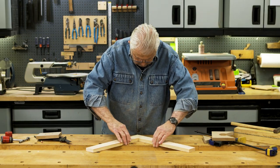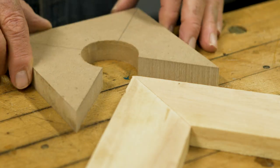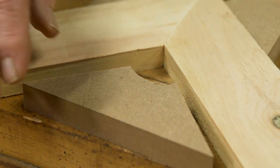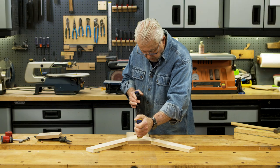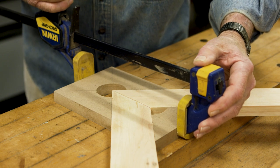This is how the clamping jig works. The larger section is placed on the outside of the miter joint while the smaller section goes inside. The two sections are then clamped together using a standard bar clamp.